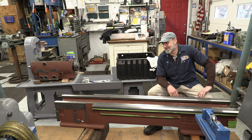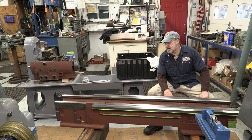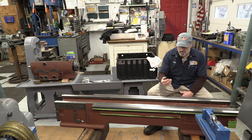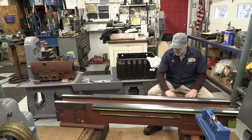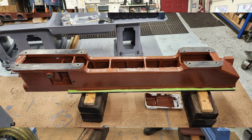This is Sunday, and of course we went up and picked up all Pearl's components there on Monday, and we had a busy week of work, and it wasn't until yesterday I was actually able to get some cleaning up and start the masking and priming of the bed itself. So I flipped it right side up. I did all the bottom first, so that I could get down into the nooks and crannies of a lathe with a paintbrush, a little foam roller, whatever. It's a pretty good challenge, but you need to have it 180 and then 180 again. And so we got two coats in some areas along the sides, and we got one good coat on the top and bottom, and slapped in a little bit in the center area from both sides, and almost got a double coat in some of those areas as well.